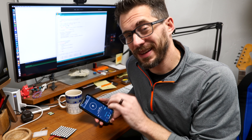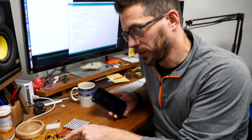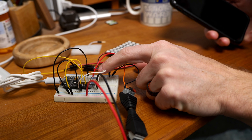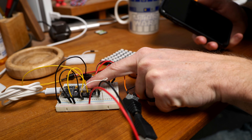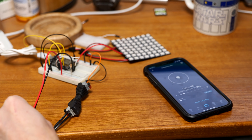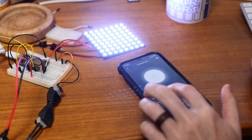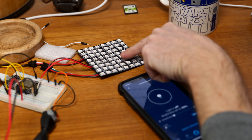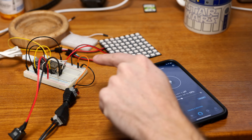I've been working on some code for this thing and I think I've got it pretty much there. This little microcontroller is an ESP board with WiFi built in. Just like the Alexa finger I made a long time ago, this thing can act as an internet-controlled device — but instead of a Belkin Wemo device, now it emulates a Philips Hue bulb, which is really handy because we're actually making a light. We've got the switch that works to turn the whole thing on and off, and on the Alexa app you can change the brightness and fade it as well as turn it on and off. These are RGB LEDs, which means you can do all sorts of color stuff if you want to spend the time programming. Now I've got this prototyped — I'm going to clean up the wiring and get it installed.